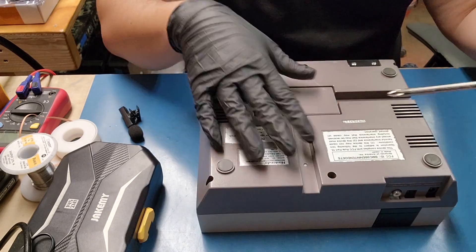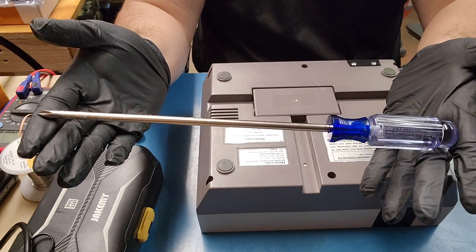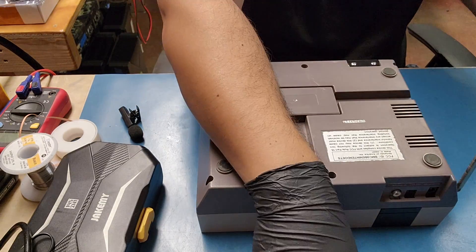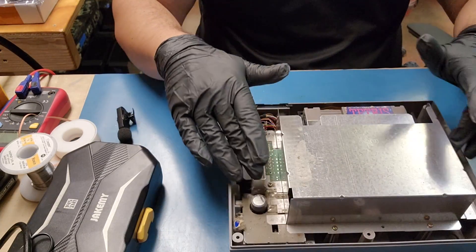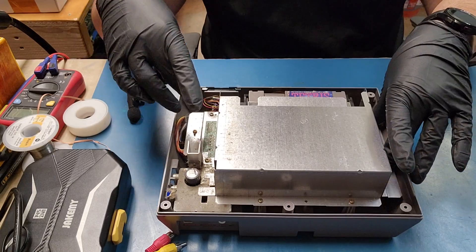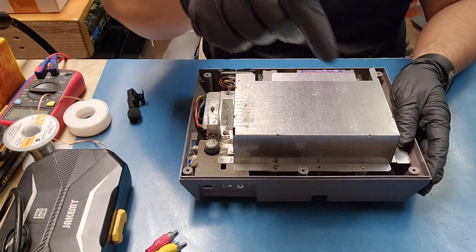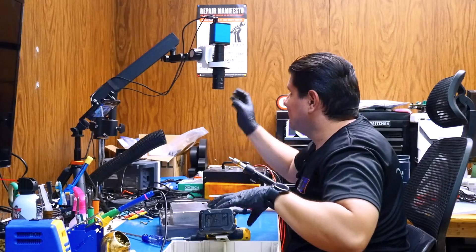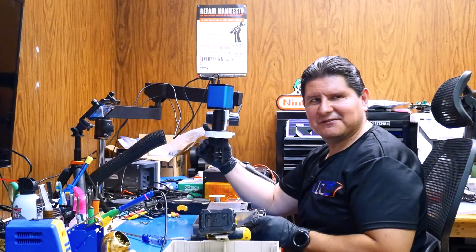There's not really much to it. You're using a longer Phillips screwdriver — you don't need one that long, that's overkill. There are six screws to remove, and then we have some screws around the rim of the console: two over here, three right here, and two more in the back. I'm going to switch over to the drill. You may notice there are a couple of friends inside this console and it's also not the cleanest.